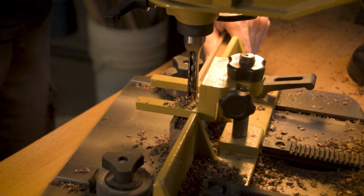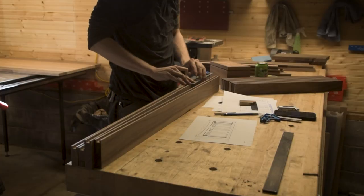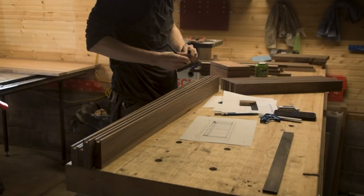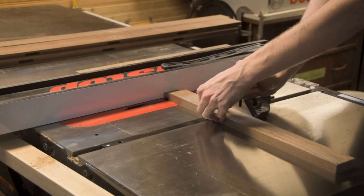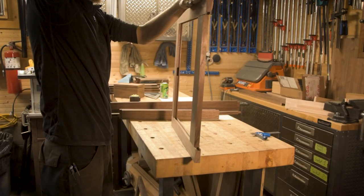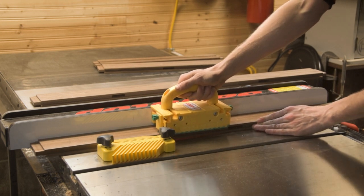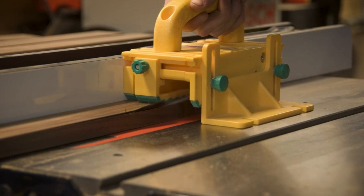The whole chest is built with mortise and tenon joinery. Working with this mortiser, which I'm still fairly new to, combined with walnut is just easy. Compared to when I built the dresser out of hard maple, this walnut cut very easily. I started by cutting a dado into all the pieces, then matched that up to the three-eighths mortising chisel in my mortiser, and from there added a simple groove around all the inside pieces.